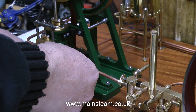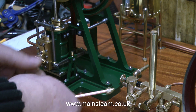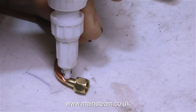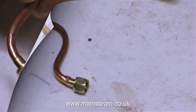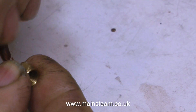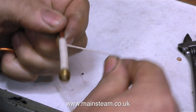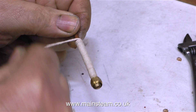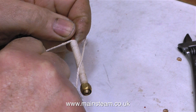This sequence is very heavily edited. I'm taking off a steam pipe, and in this clip I'm putting some cyanoacrylate adhesive on the end of the pipe. Here I've just wet the end of the string and I'm wrapping it around the pipe. I wet the string so that it sticks immediately to the cyanoacrylate adhesive — any contact with water makes it cure very quickly.